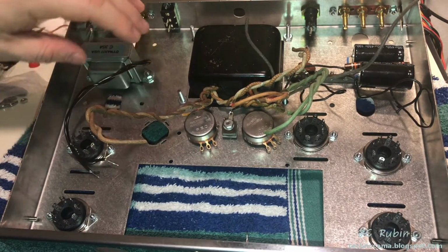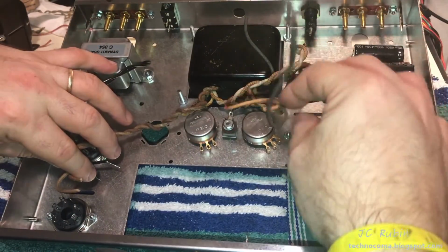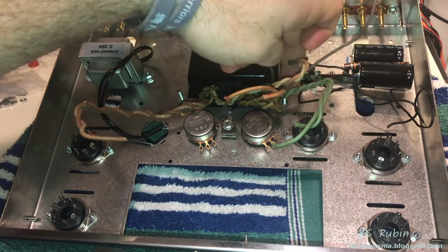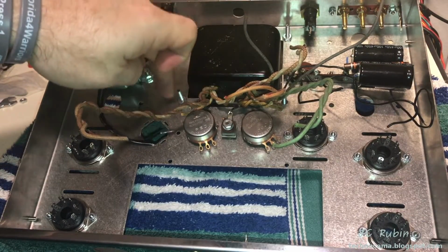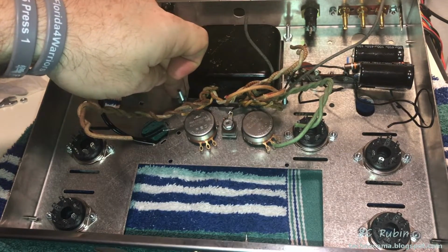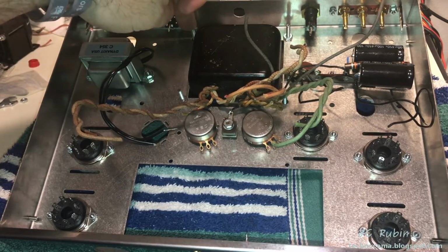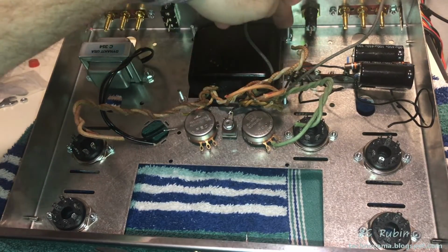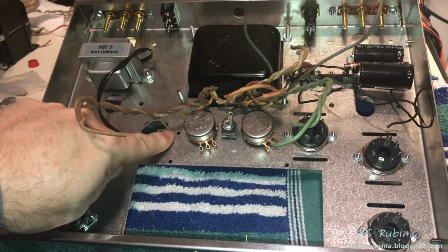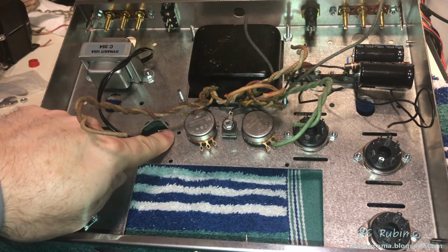I got my coil, got all my connections from the power transformer now. We can now finish mounting properly the connections here. Some of them, of course, will have some clamps, but those clamps are not going to be introduced until after the cables are soldered in. That's why I have the temporary connections. I'm going to be moving the temporary connections as required. And we still do have, believe it or not, another thing to mount right here in the chassis. This is our star ground. We'll be going here. So we're going to do that next.